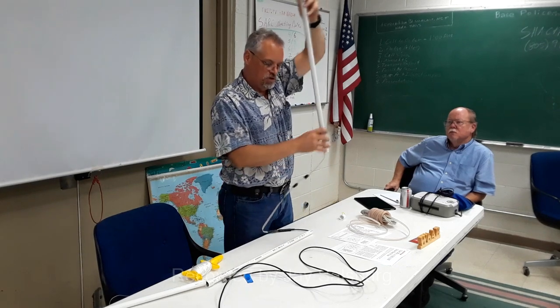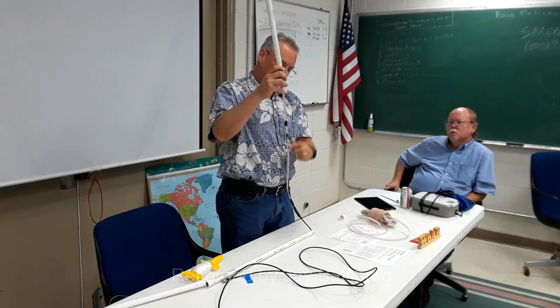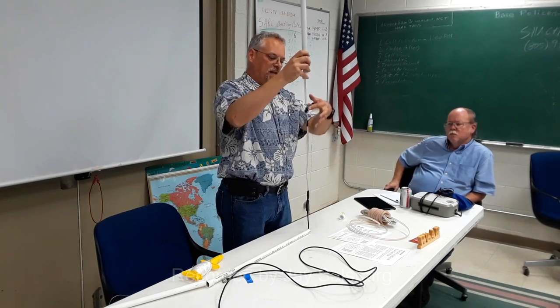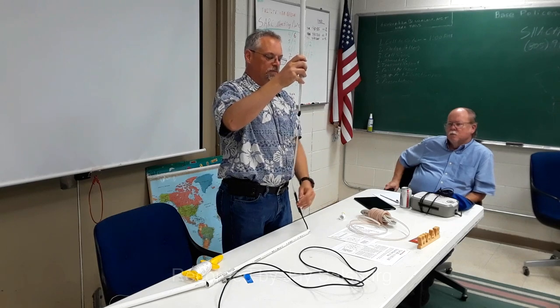We're end feeding a half wave dipole on the end. And to do that, we have to transform the high impedance to get it down to the 50 ohms that we're going to feed it. And that's what that lower portion is. Okay?